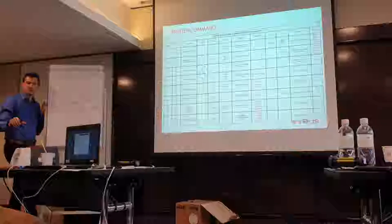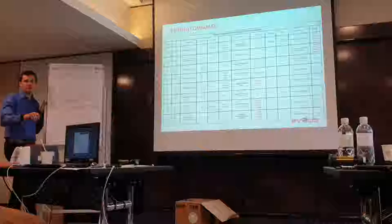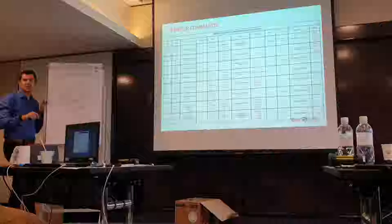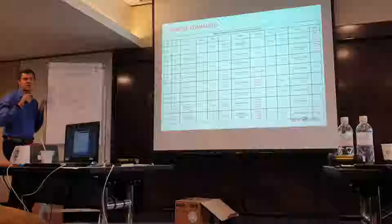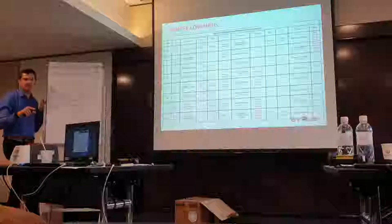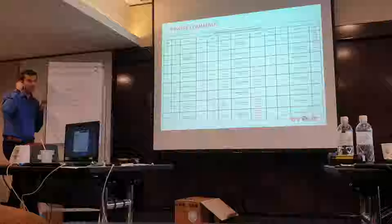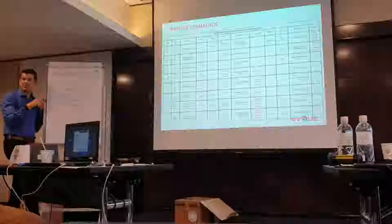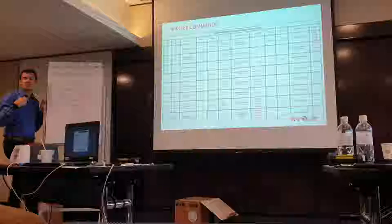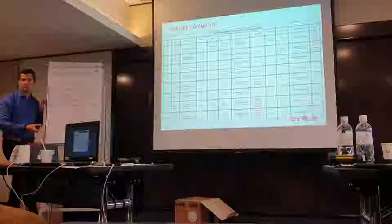If you have that, it's not a communication issue, it's not a mainboard issue, it's the PPS mode. So you have to restore the PPS mode to one. For that, there is dedicated documentation on the partner website to explain how to set it, because with no communication, it will be very difficult to send the command. You can send the command by Evocom, or by the driver, but you need to set the driver for this direct communication.